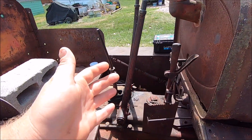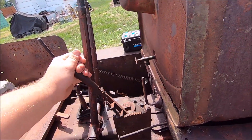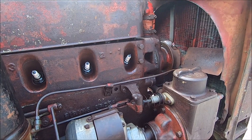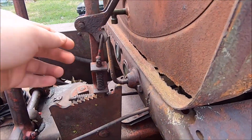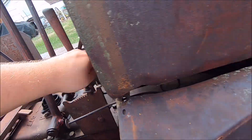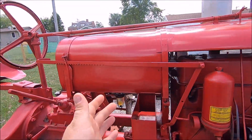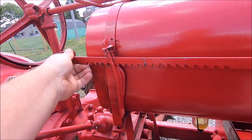The throttle on the T20 crawler is actuated with this lever that controls the movement of the throttle to the governor. As you can see, pulling the throttle back moves that rod and that spring — it's spring-tight so when you let go it locks into place, moving forward and back. Also on the crawler, the advance/retard is this little switch here — move it all the way over for advance, move it back the other way to the retard setting, and it kills the engine. On the F20 tractor, the throttle is this incredibly hokey but effective pull-and-push lever that locks in with these serrated edges.